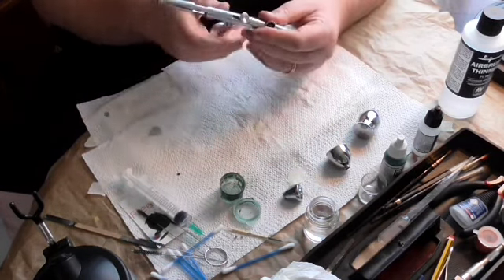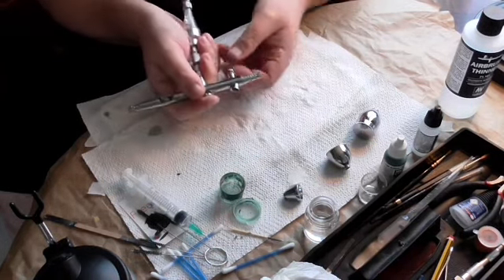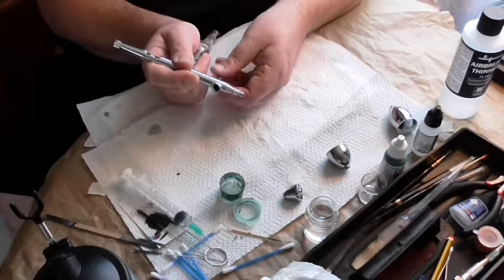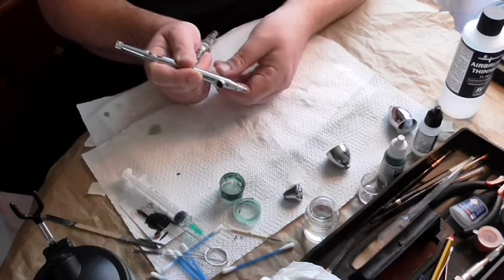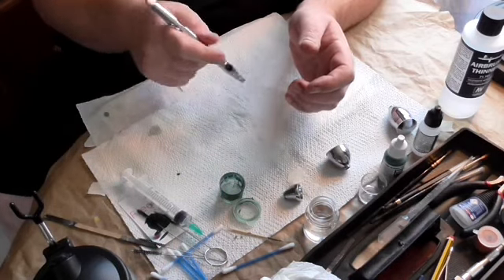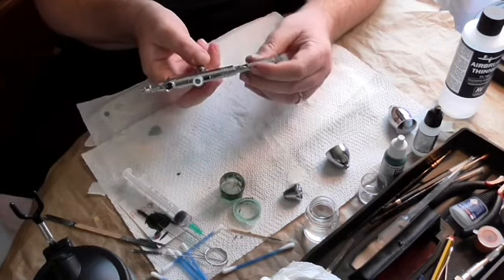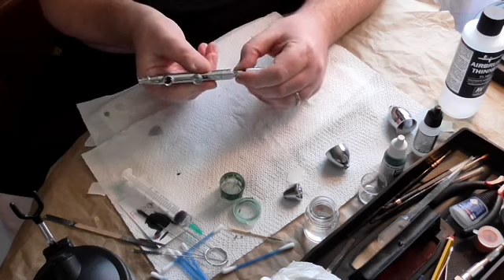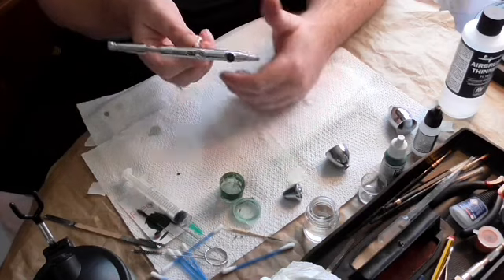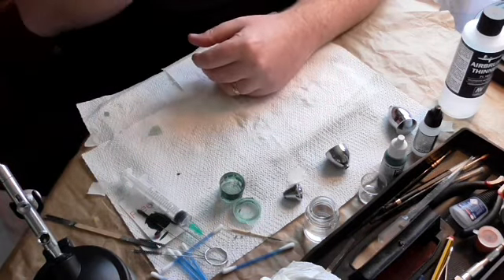It's dual action as well, which is alright — does the job. For those not familiar with this type of model, you can use this screw to increase or decrease the air flow, and here there's a screw to adjust the amount of paint you use as well, which is quite handy. It's not as great as what I was using before — it's kind of similar to a decent airbrush like the Badger and similar brands — but it seems to be alright, so I'm just going to have a play with it.